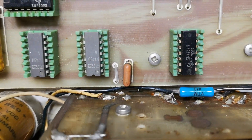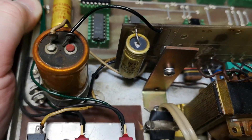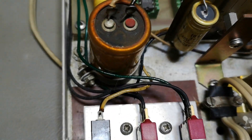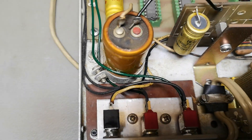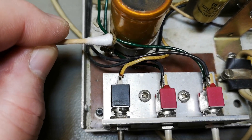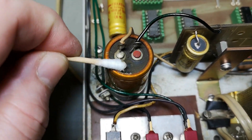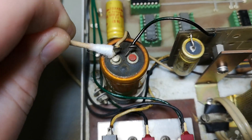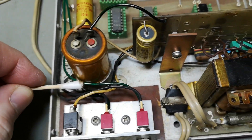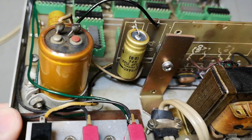When I'm looking in here I saw some goop — I don't know if you can see it, this sticky sticky stuff. I've been trying to clean it up a little bit. Look at the wires around this capacitor — you can actually see it's wet. Down here, let me get some light — see, it's still sticky. So this reveals that this capacitor actually puked. We've got some capacitor slime all the way around here. Maybe that is why we got two of them in parallel.